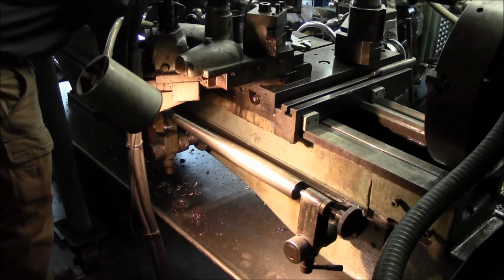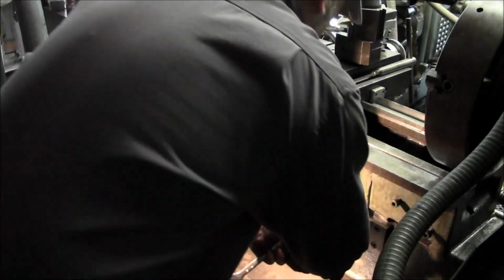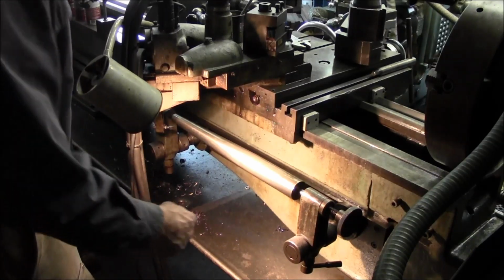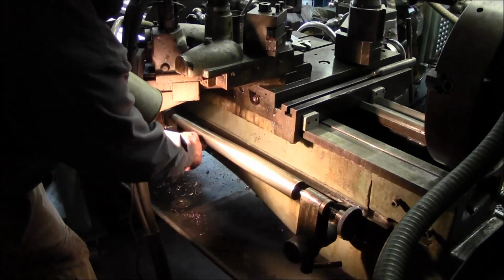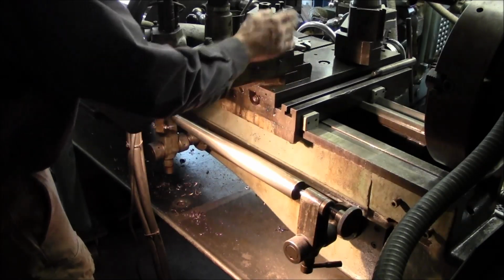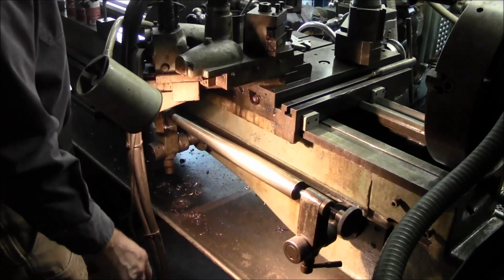Everything's tight there. Alright. Now let's go around to the other side. This will be fine. Now the finger will be able to come in and touch up and cut this taper and trace it onto here. Now we're going to turn our tool block here and get the setup with a boring bar and a bit going in there.